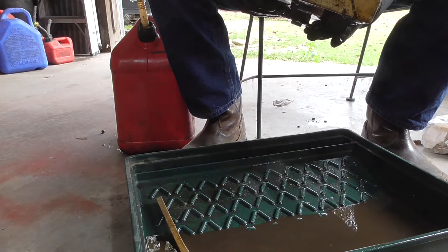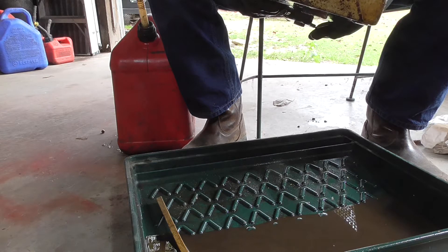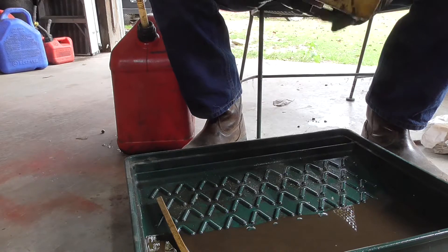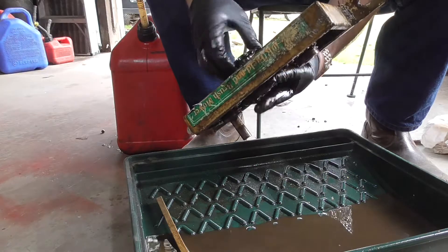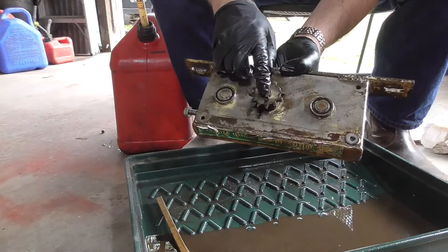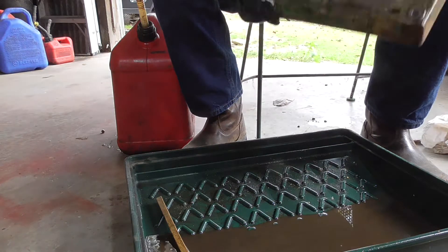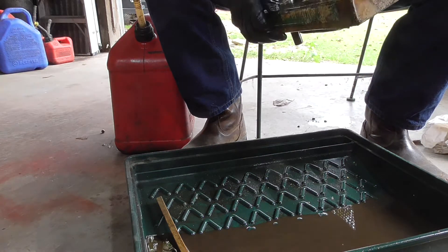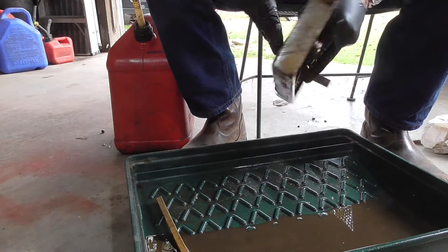Some other things I've found: these three bearings here have a circlip on them. Get a spreader in there, pop those off, and hopefully the bearings will come off. The bearings are really not too shabby — don't feel a lot of grit, not hanging up, pretty smooth. If I can't find new ones they do have a part number on them. It's a sealed bearing so they've lasted fairly well. This gear here on the back has a keyway in it, so I think this is going to have to be pulled.